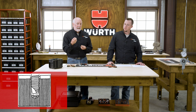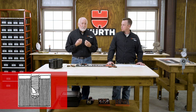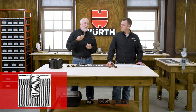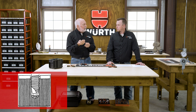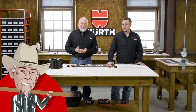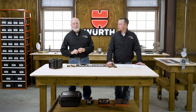People said, how can I save on that? Let's take the screw and make it be the cutting tap. So we came up with forms of thread cutting screws. The manufacturer makes the screw with a slight point and saws out a segment so that when it goes into the hole, it actually cuts its way in and forms a pretty good thread. But it takes a lot of torque and leaves a lot of material — chips to contend with. Electronics industry? No, you can't have metal chips in electronics.